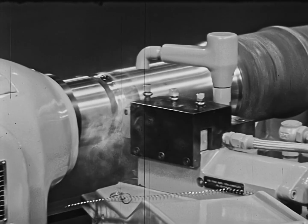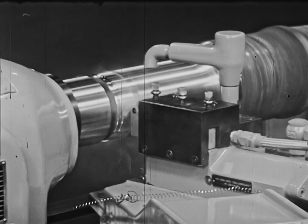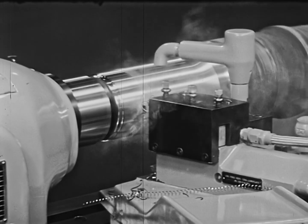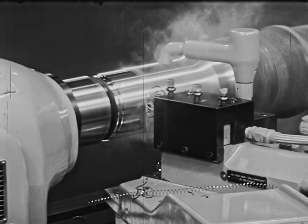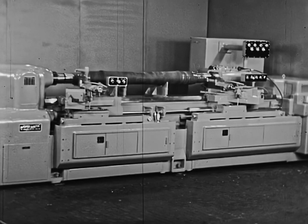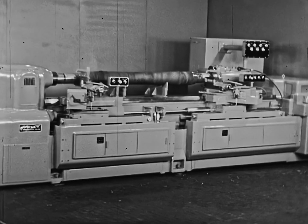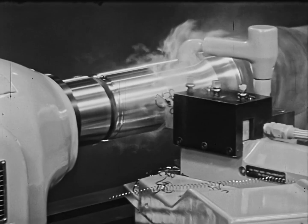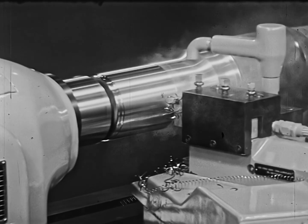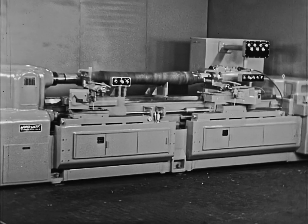The left-hand template rail has been designed for left-to-right tool movement. Carbide tools are used. Depth of cut is 1/64th of an inch. Feed is 2 inches, 10 inches, and back to 2 inches. RPM is 248. Dual carriages eliminate the extra handling of the heavy axle required for the usual work-and-turn operation. This feature alone cuts total handling time per piece to 2¾ minutes. It has also solved the problem of maintaining center distances of radii and permitted plunge grinding without excessive wheel breakdown.